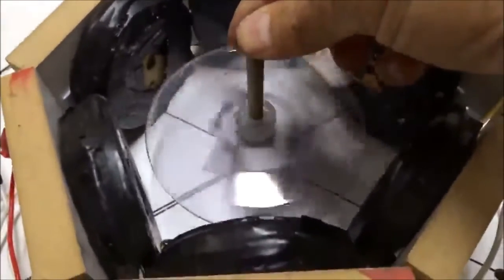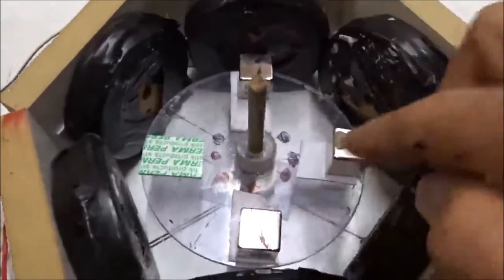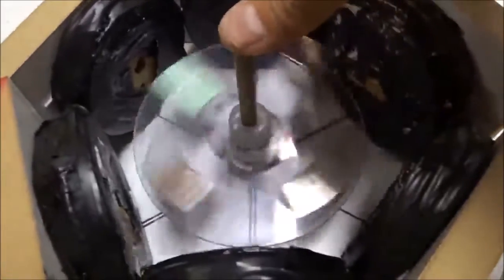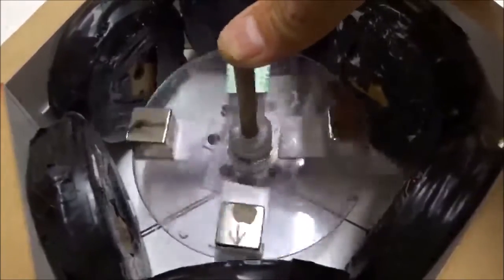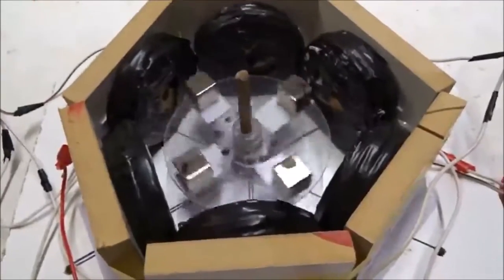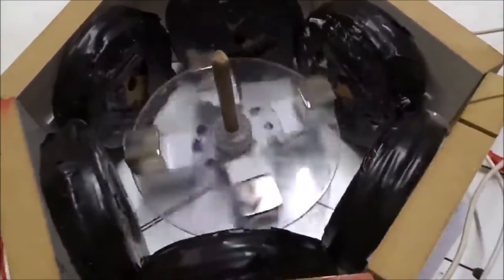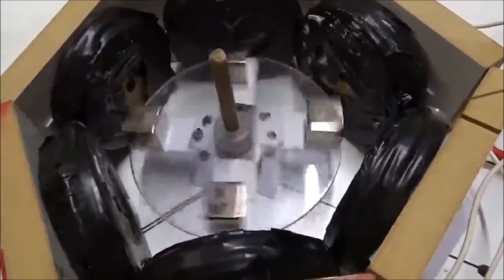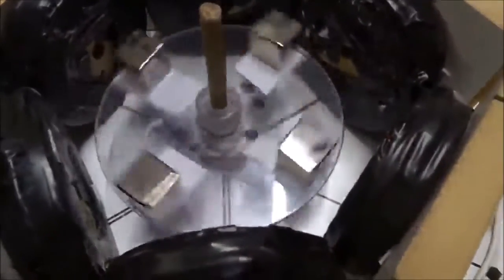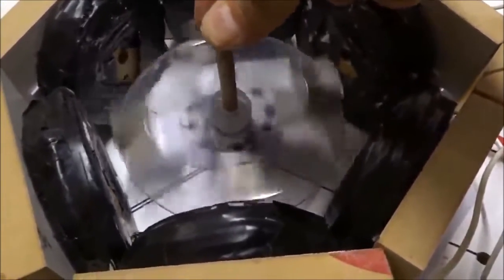What happens if we go to four magnets? We've got three magnets here opposing, and one on the right at 90-degree locking. That gives you this nice robot-like magnetic locking clockwise, which I find very, very cool. What happens when we add a fourth magnet? We add a fourth magnet in the green tape position. Lo and behold, it gets even better — now we get beautiful synchronous locking. Look at that beautiful clockwise synchronous locking at 3 Hz of UVW power. This rotor is now totally balanced. Let's go a little faster. Look at that — we can't really invent better synchronous starting than that.